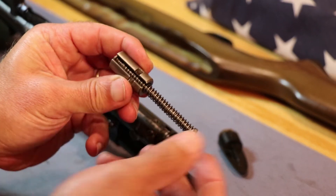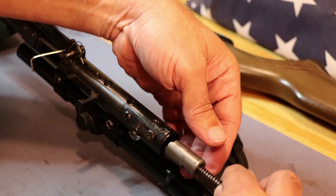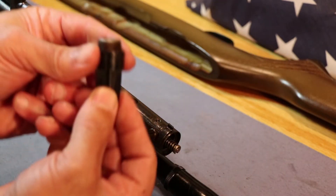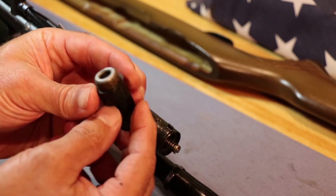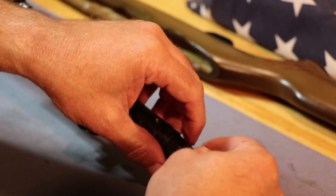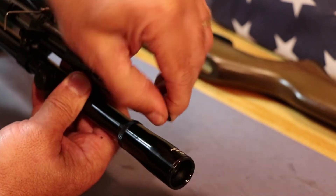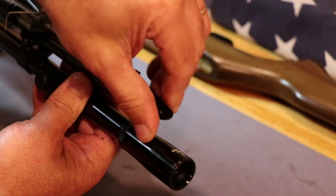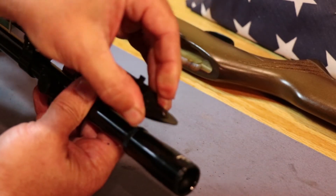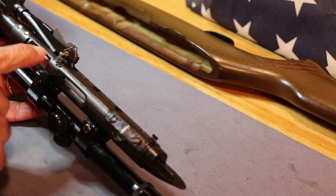Then take the other part — the rear part of your bolt. There's that T-slot; that's going to fit right on the firing pin. Get it pushed in there. You should be able to push it almost all the way forward. Take your butt plate — the end of your action. I'm not sure what it's made out of; this is aluminum here, but this almost feels like plastic, so I think it's over-molded onto it. Screw that in there. It's not going to tighten all the way down because then it'll be kind of out of time. There's tight — that's not going to fit in the stock the right way, so you'll back it off just a little bit. Then pull this Allen key out — that just keeps the lifting mechanism from hitting up against your bolt.